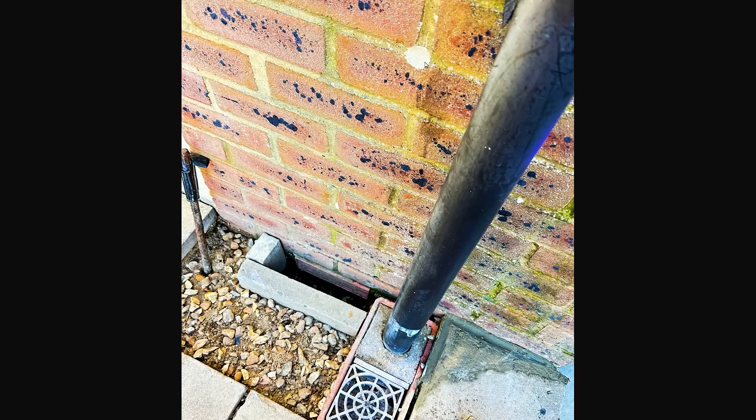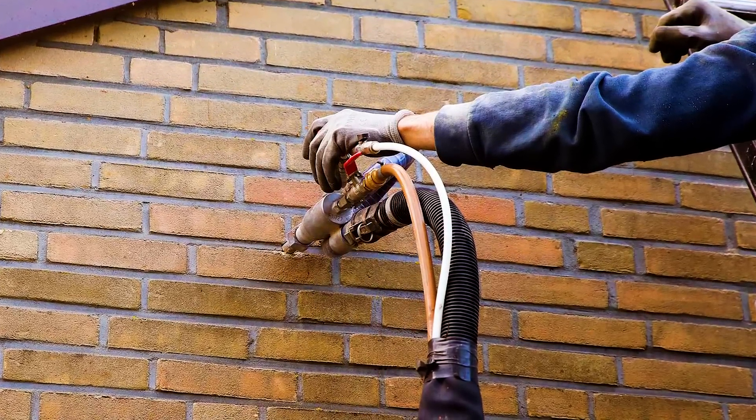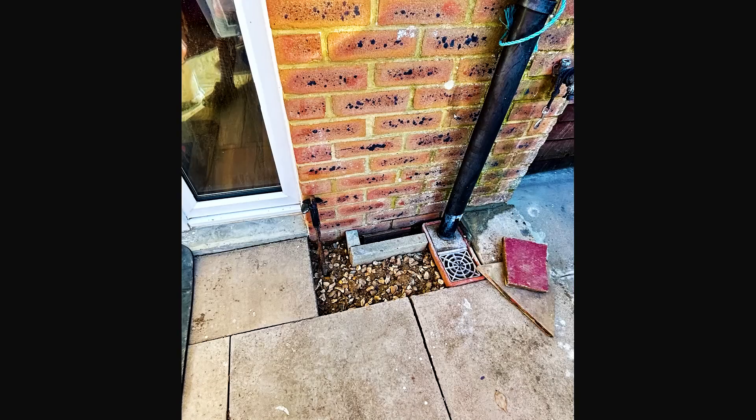One more thing - this is where having lots of photographs helps. You can see that at some point this house has had cavity wall insulation put in. A lot of people say that's the cause of the damp, but it's not causing the damp itself. If the damp is getting in and evaporating into the cavity, it will soak the insulation, but if the job had been done properly in the first place, she wouldn't have this problem with the cavity wall insulation. There's a lot of drying out to be done in that property.